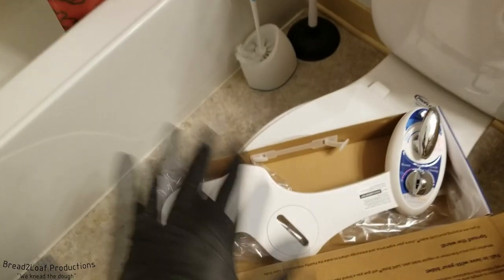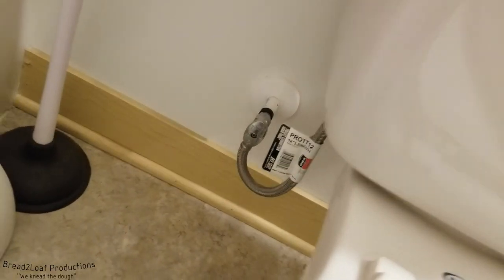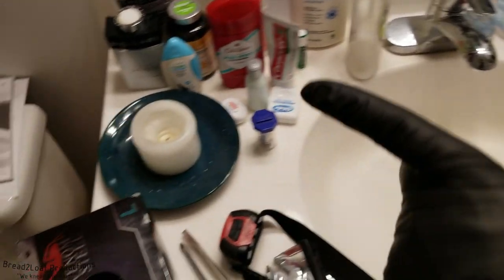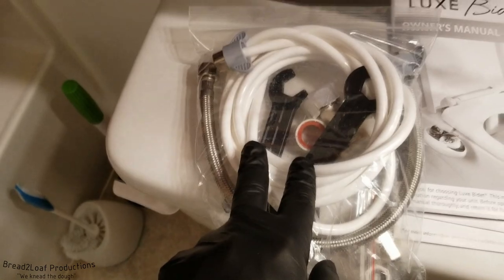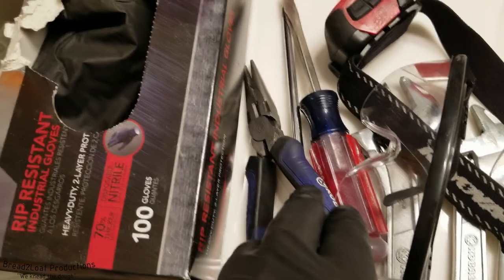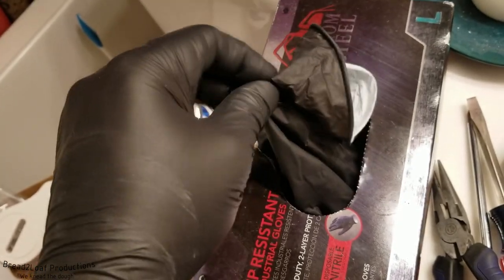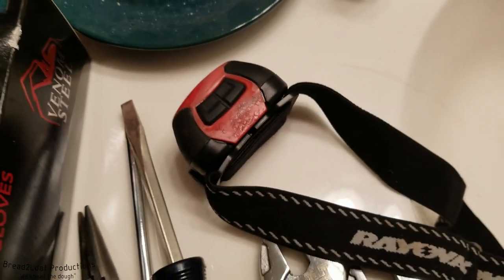This installs to be pretty straightforward. Just got to mount the bidet and then connect the water lines up to it. It gets its cold water from the fill line on your water tank on your toilet. And then it actually gets the hot water from the sink — you go underneath the cabinet and connect the T fitting to that hot water line and shoot it over to the bidet. Some hand tools you might need: crescent wrenches, box wrenches, maybe some needle nose pliers. Of course you're going to want gloves and safety glasses.